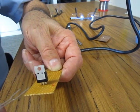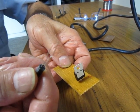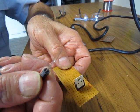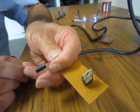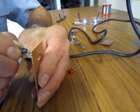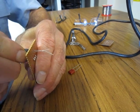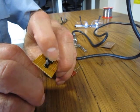From the data sheet, we know which leg is the input. In the video, it is on the right side. We will now add an electrolytic capacitor, which we know is polarised. The longer leg on the capacitor represents the positive. The positive of the capacitor will share the node with the input, and the negative of the capacitor will share the common node of the voltage regulator.